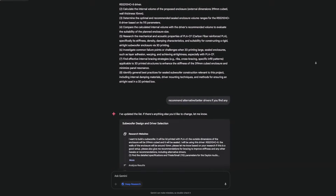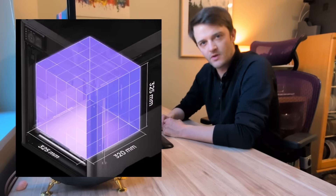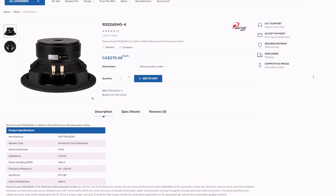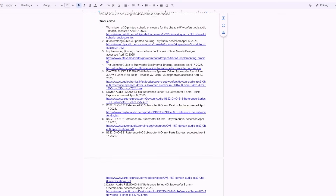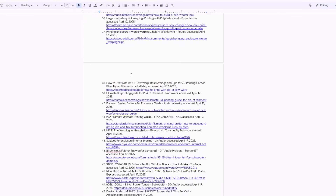With the enclosure size fixed, I set out to find a driver that would perform adequately. With no deep expertise in driver selection, I did what any self-respecting millennial would do — I asked our AI overlords for help. I coerced it into making calculations and driver recommendations for the resulting 0.8 cubic foot build volume my printer could produce. After fact-checking with my own calculations and online forums, I procured a 10-inch Dayton Audio reference driver which theoretically would perform exceptionally in my enclosure. I also tested Gemini's deep research feature and will leave a link in the description.